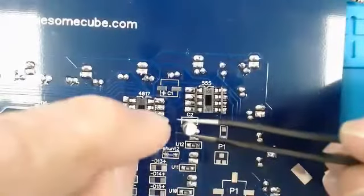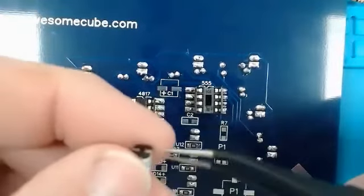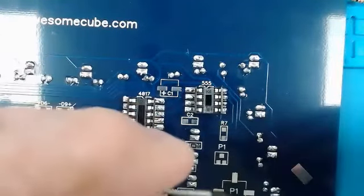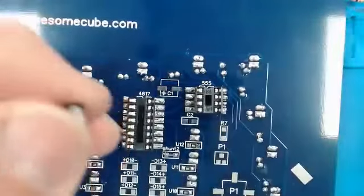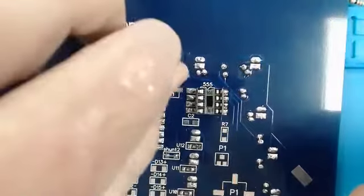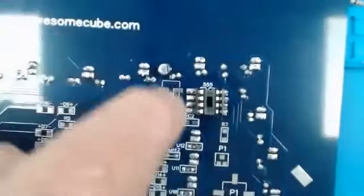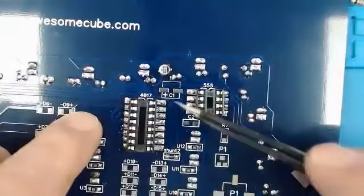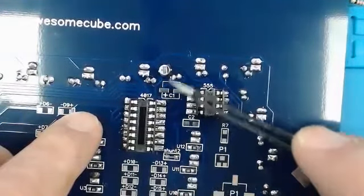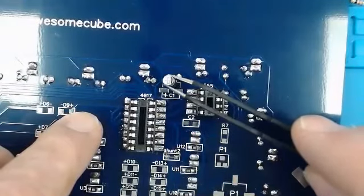So you notice one side of it is black. The black side is going to be the negative side. Down here at the base of it, it's got two little metal pieces sticking out. That's going to be what we solder to there. So we're going to put this in the C1 spot up there. That's the positive side, negative side. Our black side is the negative side. So it's going to go in right there.